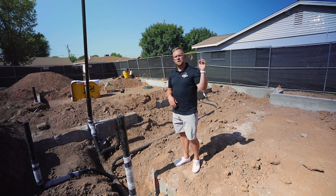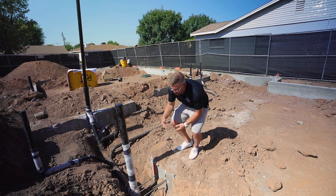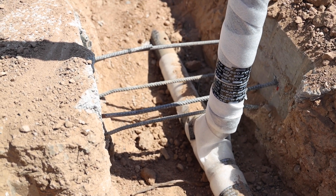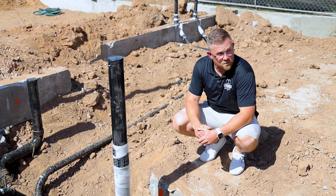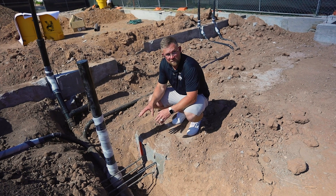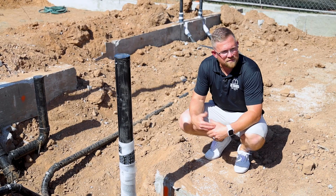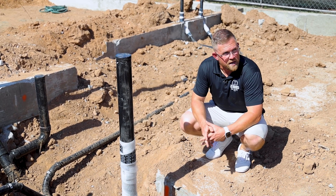In the first location we were able to go completely underneath the interior footing, but in this location we had to box out the interior footing. As you can see, the rebar is currently exposed within this small 18-inch gap. This was planned ahead of time to connect our butler's pantry, powder room, and water heater through this portion of the footing without having to chip out concrete or cut rebar, which would have a detrimental effect on the overall integrity of this footing and bearing point.